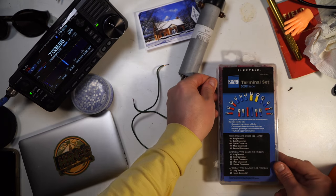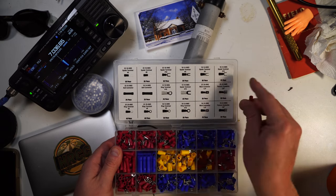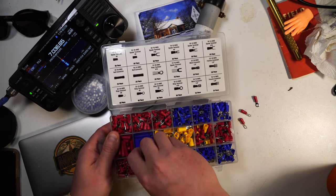Automotive connectors — let's talk about automotive connectors. You should just go down to Harbor Freight and buy one of those like 350-piece jobs that they've got. I'll post a link in the description to something on Amazon that's cheap. Cheap is good here when you're making antennas on curtain rods. Basically, there's going to be some kind of mounting screw somewhere, likely connecting the rod to the mount. The mount could be wood, it could be metal, it doesn't really matter. You're going to use that screw to get the connection to the rod. So you'll make an automotive connector — two wires with eyelets on all sides — that will connect to a balun.